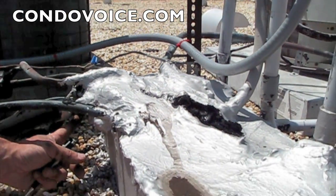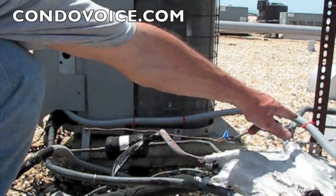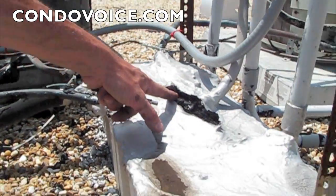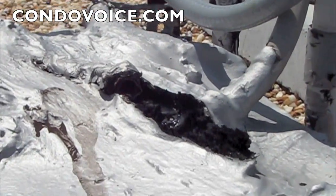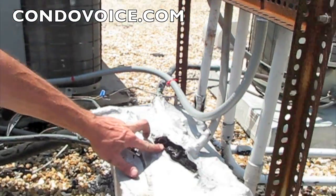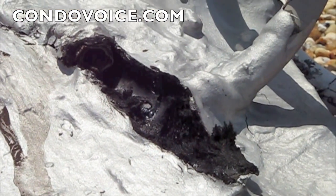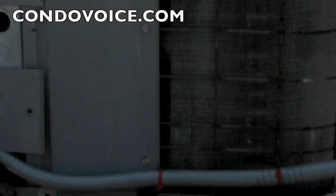Rather than remove that and cause a leak in the pitch pan tar, we just ran the new line up above it — this one right above it. Instead of going down through, I cut it off short here and underneath. My concern was that if I removed it from the tar there would be a leak, so I just left it in the tar. The tar will actually heat up and get soft and malleable — you can rework it around that and it's not going to hurt anything or leak. Not a problem.